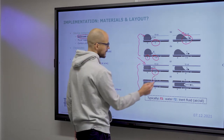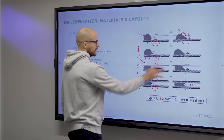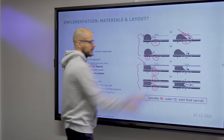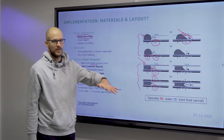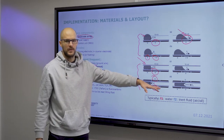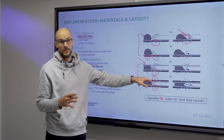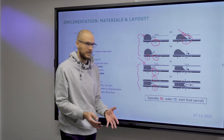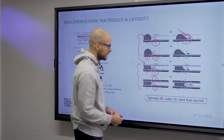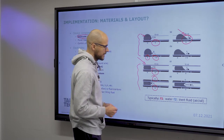And you can also have the driving electrodes on both sides. This approach would assume that the top plate has a conductive layer, but it is not patterned. This one is the most expensive, where both sides have patterned electrodes, and this one must be transparent. So you have the substrate side. Substrate is typically non-transparent, but the opposite side, the counter electrodes, they must be transparent.